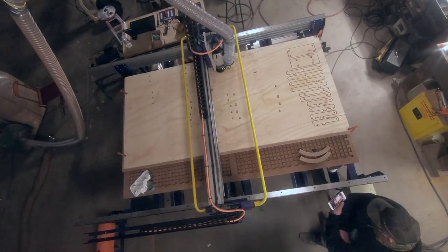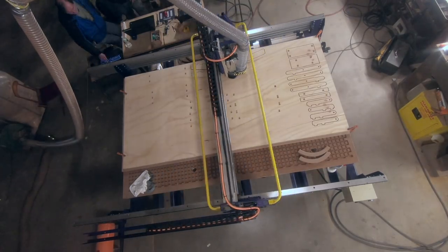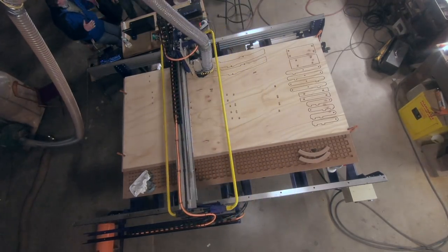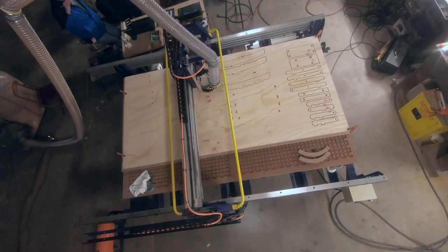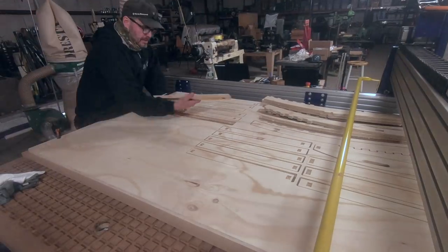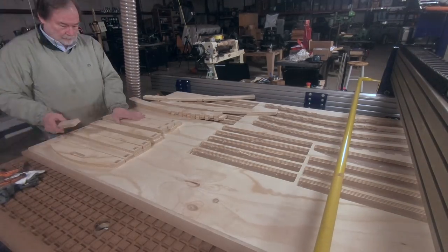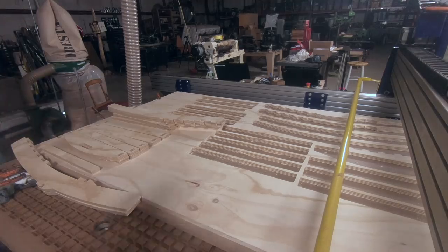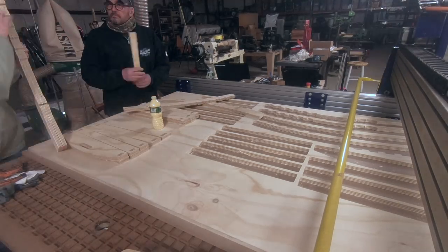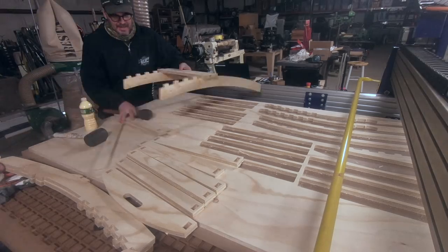This is a really cool file. It is part of the training exercise from ShopBot. It is a chair. It's a pretty classic design. It's nothing groundbreaking. The two parts plug together, and then when they unplug, they nest together so you could store it. So it is a folding beach chair, and it's made out of just a small portion of a sheet of plywood. And with good nesting capabilities, you can probably get three chairs out of one full sheet of plywood.